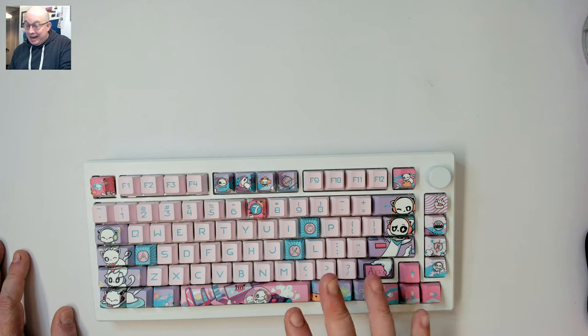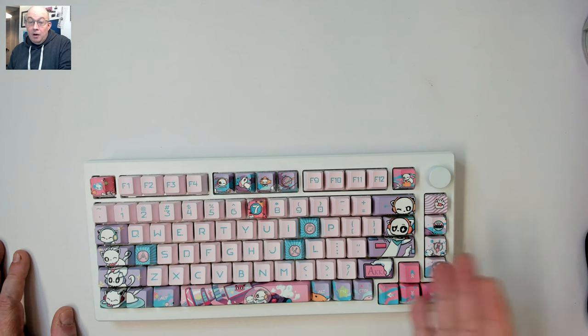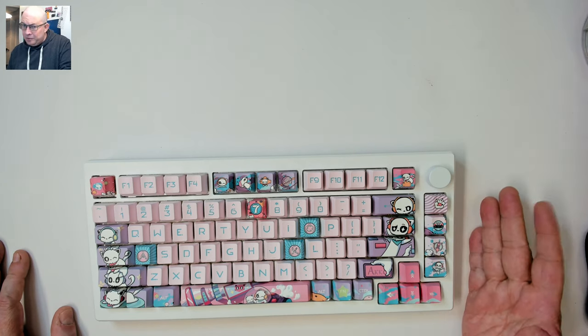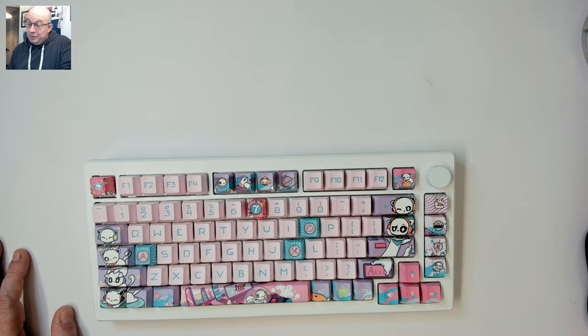MOD007 PCHE, or I would assume any of the Akko HE keyboards, because I believe this is their first one, but I could be mistaken, but I'm sure they're planning more. Everybody's putting one out. But this is the first one that I've seen that has the option for mechanical switches. I mean, 3-pin, but that's fine. If you have 5-pin switches and you want to use them there, you just have to clip off the plastic pieces and they'll go in there because they're still 3-pin.